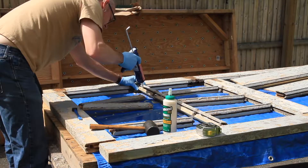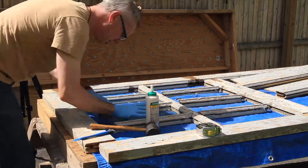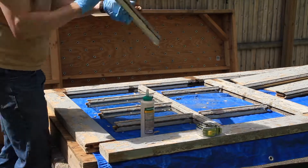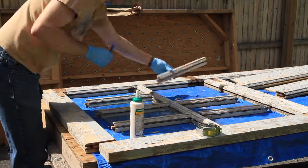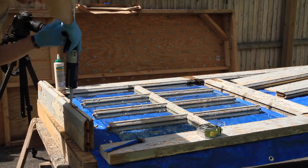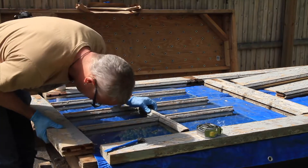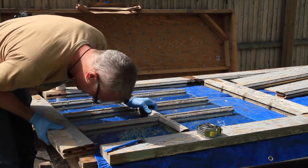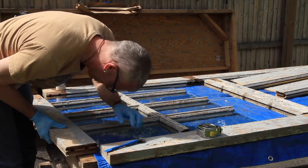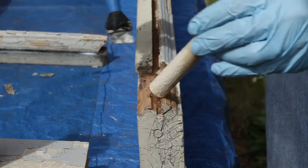The only trick of putting it back together is that the glass had to be caulked in, and the wood parts — the rails and stiles — had to be glued in. At the point where the corner of the glass meets the wood, I had to be careful to make sure the caulk didn't touch the wood and the wood glue didn't touch the caulk, so I didn't end up gluing in a glass panel or getting only a caulk joint on the wood.